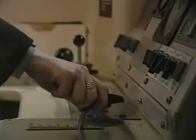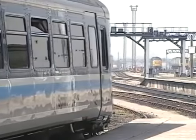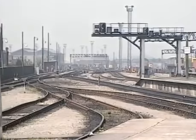The driver must try for power without operating the traction interlock switch and if successful may proceed. He must report the defect at the next station where fitting staff are available and he must enter the defect in the unit's repair book.